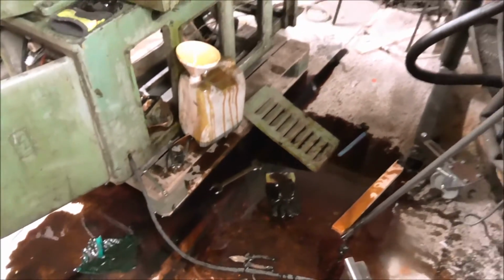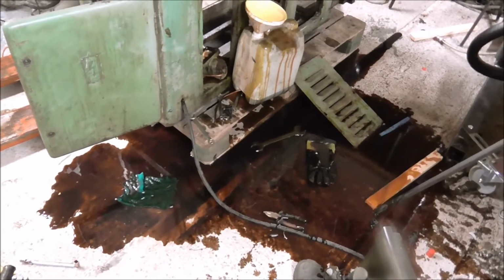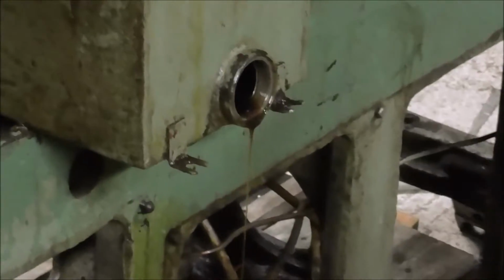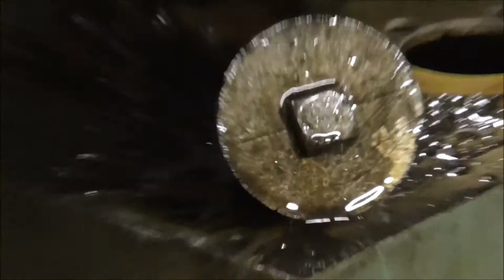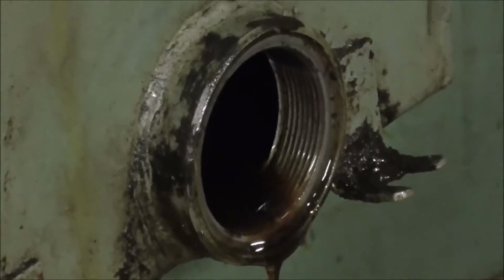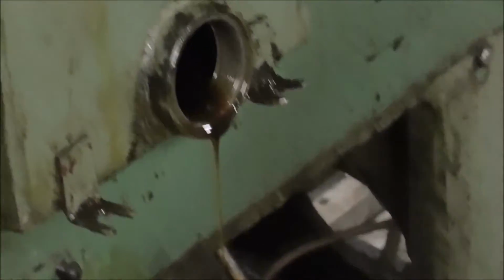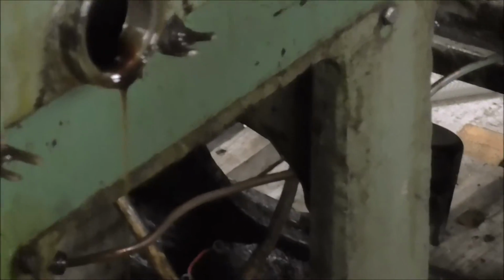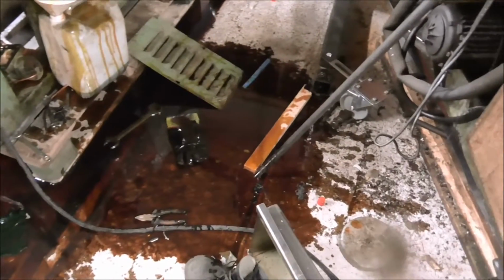When you have this lathe and you want to drain the oil tank, be careful with it. What happened is that it has this big, large oil plug, and even though the plug was big, I still somehow thought there was a way to get the oil out little by little, but no, there is actually this about 60mm hole, and the oil comes out of there in maybe 2 seconds.